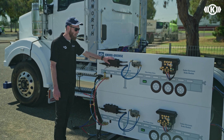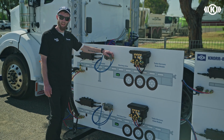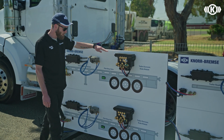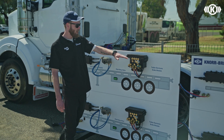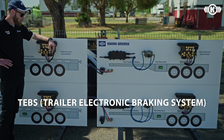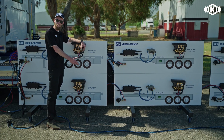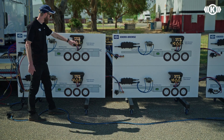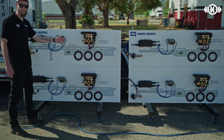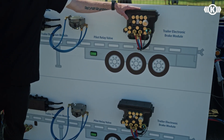Each trailer is set up with a TRM suited for trailer to split the power and CAN. We've got an R6 relay valve to convert that pneumatic control signal into the local TEBS on that trailer but also send it to the rear trailer behind. We've got a KB TEBS brake module with a pressure sensor fitted on the output side that will normally run to your wheel end or your boosters, and that pressure sensor will activate the green lamps fitted on the board — when the green lamps are illuminated it means that TEBS module has a brake output application.